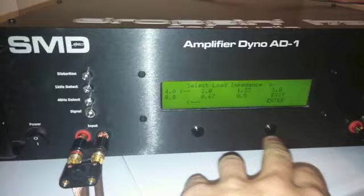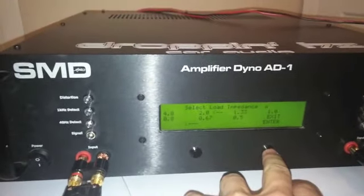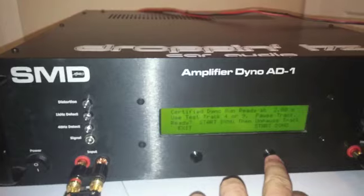All right. Let me go keep my charger on, keep this thing charged up between runs. When I first turned it on, the amplifier did kick in to protect. It's over 16 volts, so I had to cut the charger off.